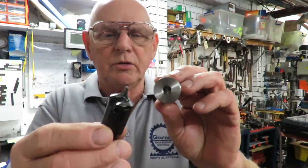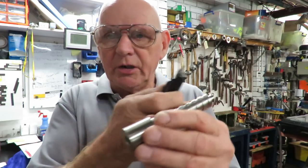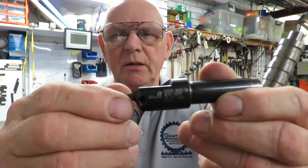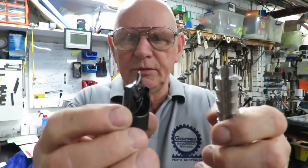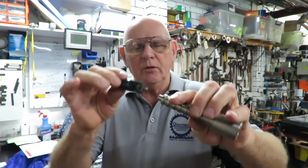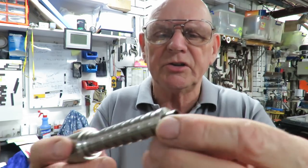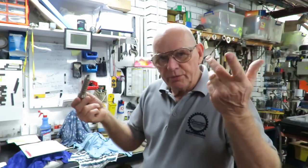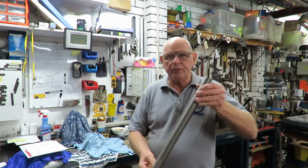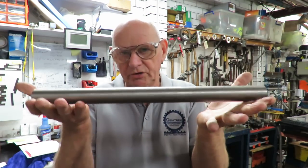The final work was to round out the edges, because cables have to go through this. I used the No. 9 cutter, which I've featured many times before — it's a wonderful thing and it's radius, so it was very good for doing the radius inside there, on both ends. This end here is quite thin — it's an eight-and-a-half millimetre hole and a ten-millimetre spigot on the end. This will be featured in the future; it's for an experimental job. We started with a bar a bit longer than this piece, and you're looking at $150 just in that piece of titanium.